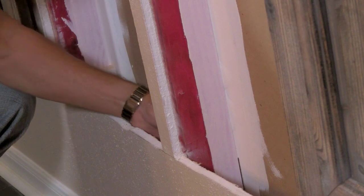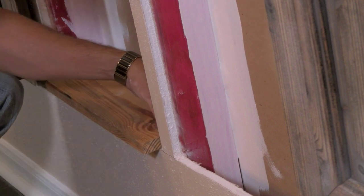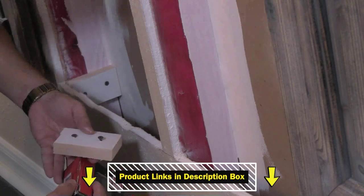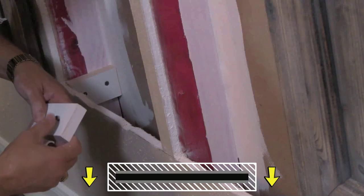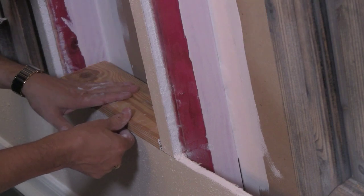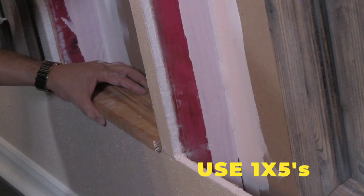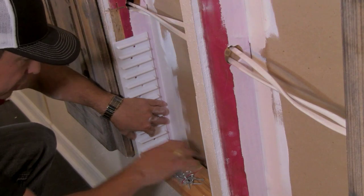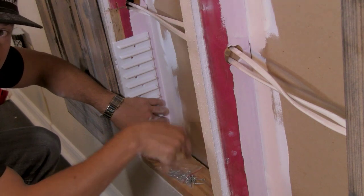Once you put this next one in, you want to make sure your shelf is pretty level. If you're wondering what kind of screws, these are called fine thread drywall screws — they're an inch and a quarter; I'll have a link in the description. This is a one by four — Home Depot has one by fives, so they'll stick out about a half inch further. I'm lining up to the edge, pushing down on this board but not too tight. I still want to be able to take this board out so we'll have a little hidden compartment underneath.